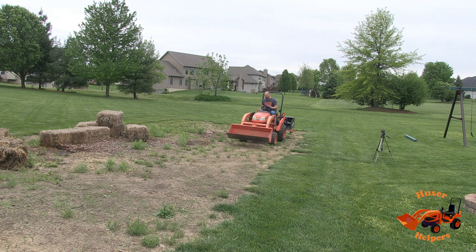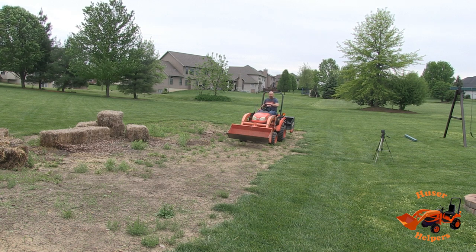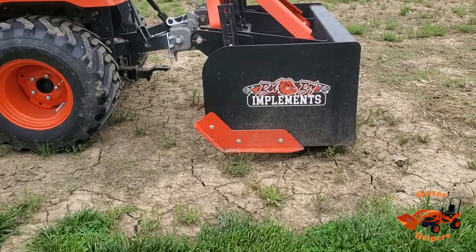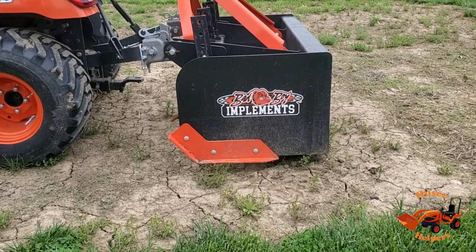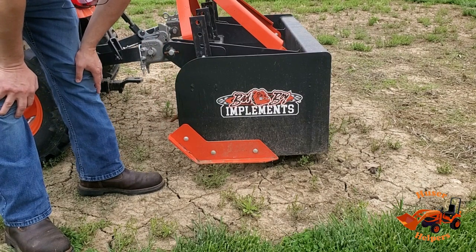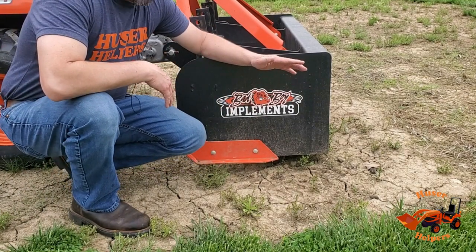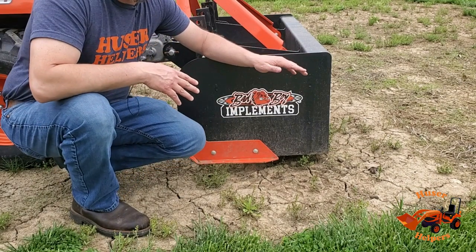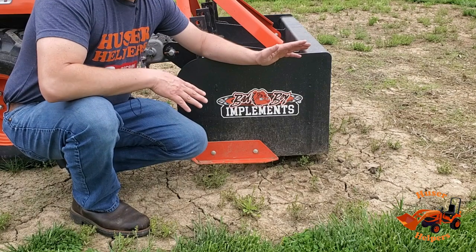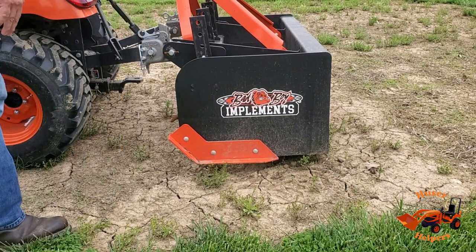The first thing I'm going to do is get the box blade set up in what I call the neutral position — kind of where it's flat and sitting right above the skids. On my Bad Boy box blade they have these basic skids. The cutting blade is actually about a half inch lower than this, and the intent is you're never going to cut more than a half inch — you shouldn't want to cut over a half inch because the horsepower of these tractors won't pull it. If you're cutting an inch or two inches it won't pull it and you'll end up with a lot of uneven ground. Right now I've got it set flat so I can lower it down and we're going to be pretty much neutral.